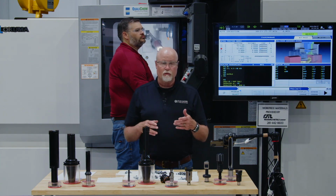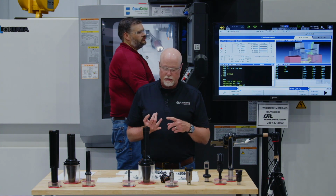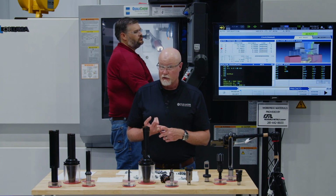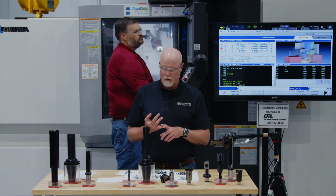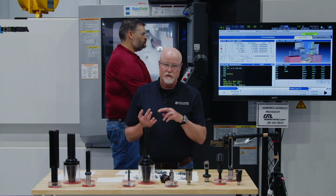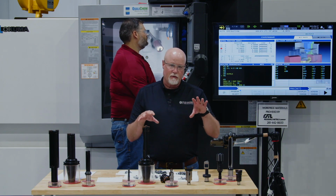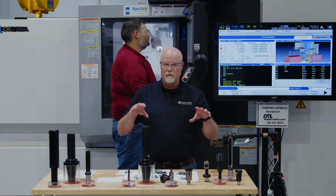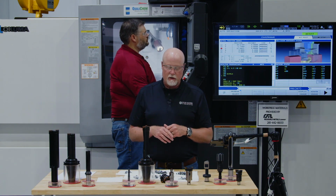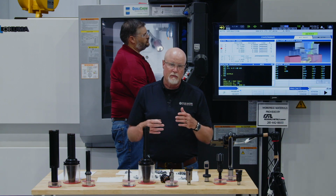The types of port forms we can do are J1926, which creates a UN style thread, and ISO 6149, which creates a metric thread. They're very similar in shape, form, fit, and function, except the type of thread is different: inch threads or metric threads. On the metric one, you have the option of an identification ridge. If I have a mixture of inch and metric threads on the manifold, there'll be an ID ridge on the spot face that lets you know those particular threads are metric.